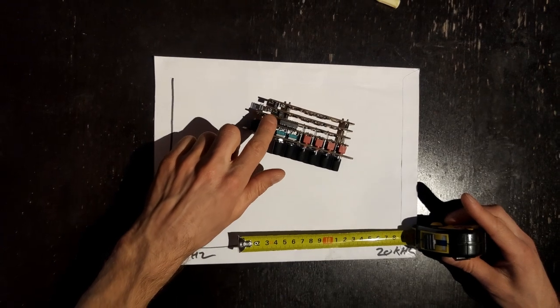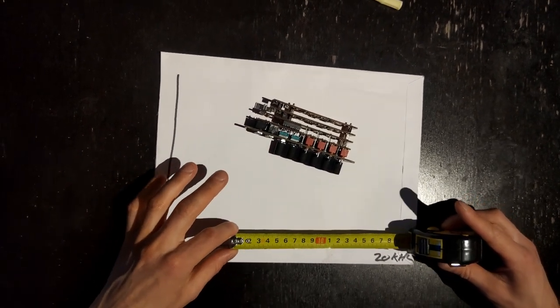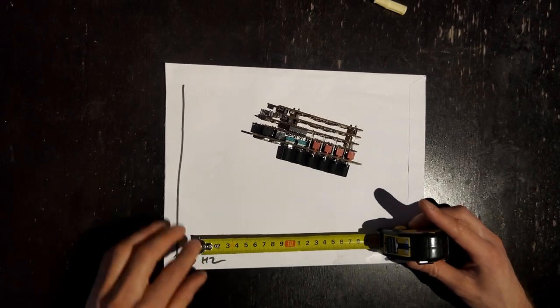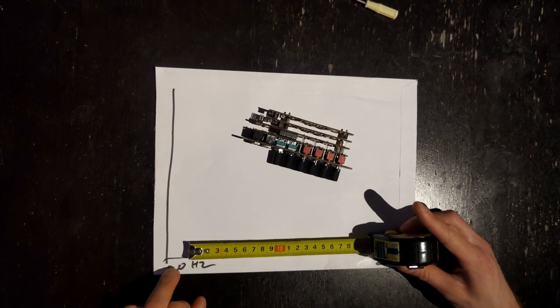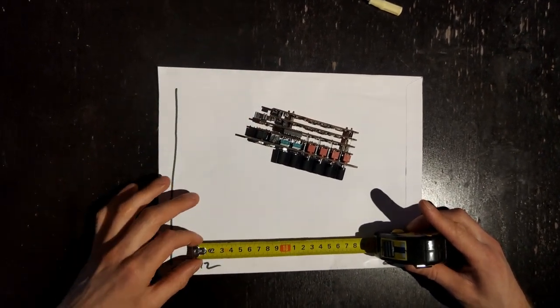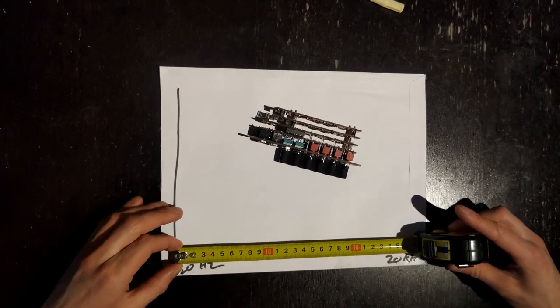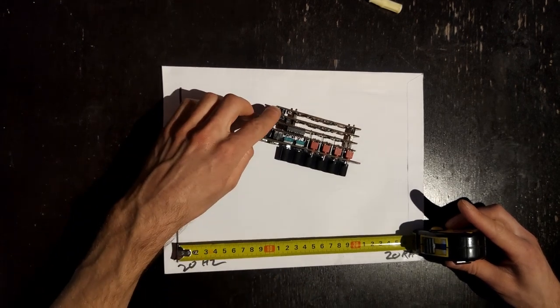So I'm going to turn the offset of the low pass filter counterclockwise, which is going to move the center of the active range of the knob more towards the middle of the audible frequency range. And then I'm going to also increase the gain by turning it clockwise, which will ensure that I cover a broader spectrum. And I can do exactly the same for the high pass filter.